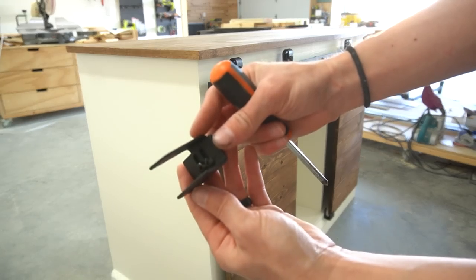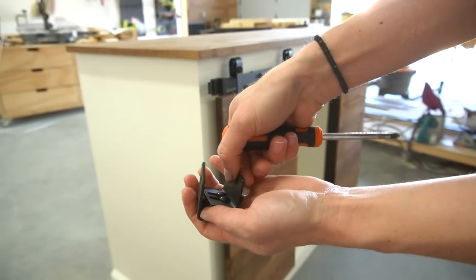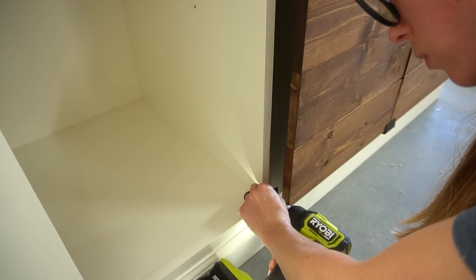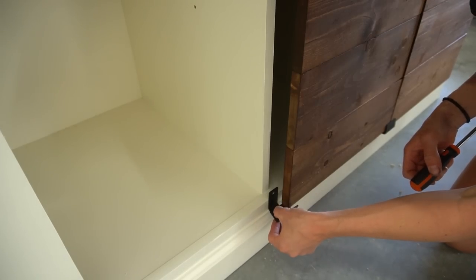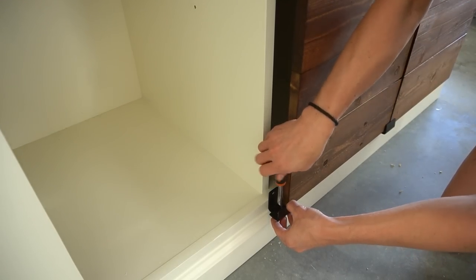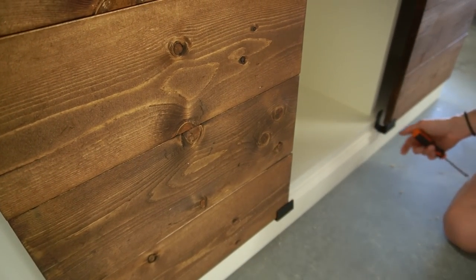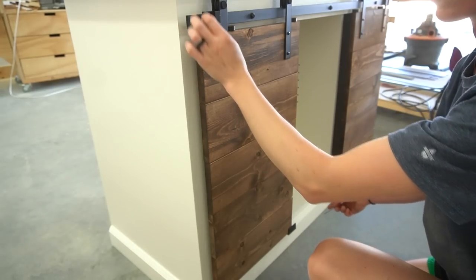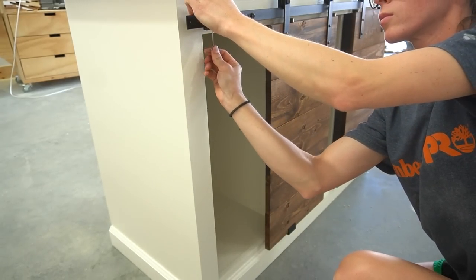The last part was installing some guides to help keep these doors from swinging back and forth. The kit comes with these guides — they're made of two pieces. I screwed the L-shaped bracket to the face frame right above the baseboard, then secured the front piece of the bracket and adjusted as needed to get the doors where I wanted them. Finally, I adjusted the stops on each end of the rail where I wanted the doors to stop rolling — there are just some set screws on the bottom that you can tighten and loosen as needed.